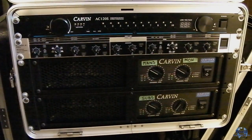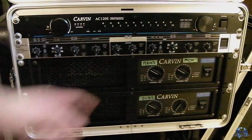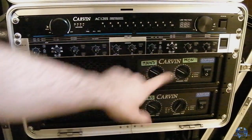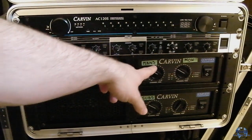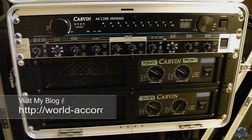The power amplifiers are not a volume control — that's where a lot of problems start. You don't want to turn these up to zero; you want them as low as absolutely possible. The more you turn them up, the more signal noise you'll pick up. If your system sounds noisy, chances are the amps are cranked. If you blow horns frequently, that's likely the reason. I'd go up to about 11 o'clock at a gig — that's plenty of power. This is a sensitivity control, not volume — as long as you're running unity gain out of your main mix, you shouldn't need to turn the amp sensitivity up very high.